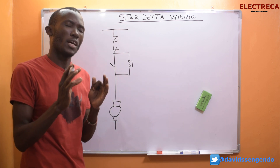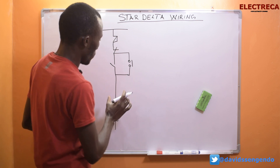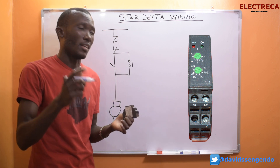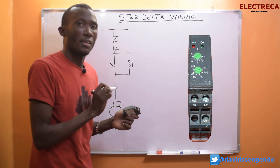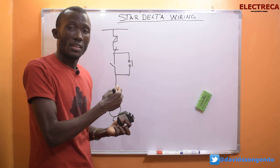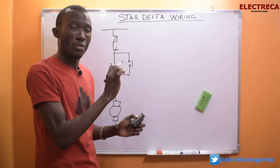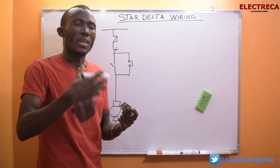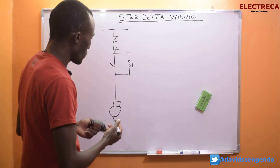Follow carefully, and if there is anything I didn't explain well, comment below. This is a timer, and in this circuit the timer is the one that switches between star and delta. One key point to keep in mind when wiring a star-delta starter: the timer and the star contactor come in at the same time, and the main contactor comes in last. If any circuit out there engages the main contactor first, that's wrong. The correct way is the star contactor to come in first — you don't supply power to the motor and then later connect the star; that's not practical and can ruin the motor.